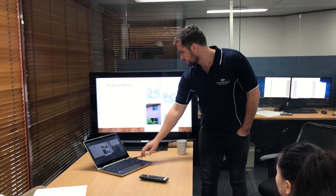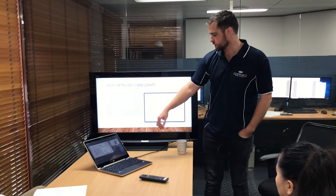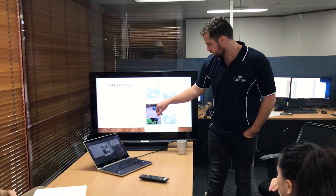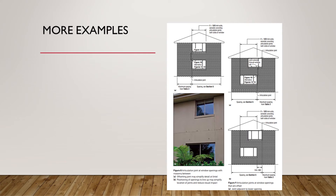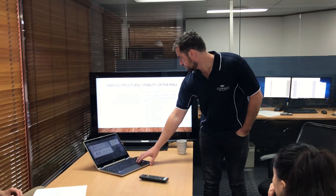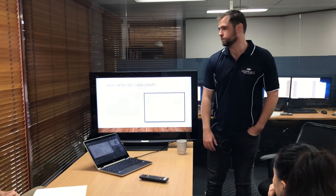When we've got a section of wall that has windows 900 by 900, we want them no more than five metre spacing. Where we've got full brickwork, we follow the standard for that section. For a section of brickwork with 900 by 900 openings, we don't want to go more than five metres. A section of wall that doesn't have 900 by 900 openings can go back to that standard. If we've got massive openings, you might want to put a joint on each side of the doorway — for large doors, put one on either side.